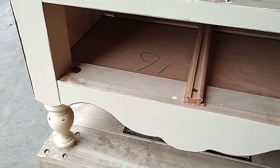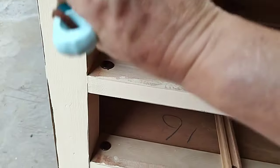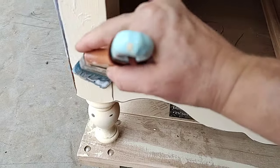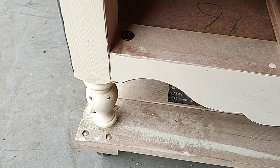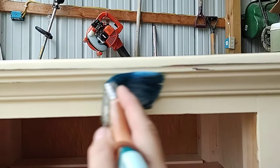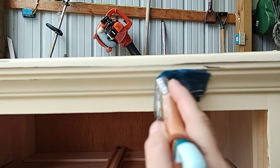Here is the mud paint matte clear coat that I used on the entire piece — I'm putting it in its own bowl to avoid any contamination back into my clear coat. If there was any dust from sanding, I don't want that potentially added to a future piece. I just had to slow down and look at that beautiful crackle. I put three coats of clear coat on the top since it'll obviously get the most wear, whether it's a nightstand or a side table. Then I put two coats everywhere else to seal that clay paint — you want to make sure it has a good sealant on it. Here's the final reveal.